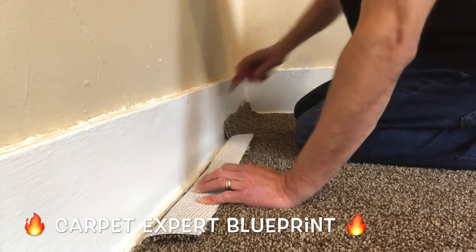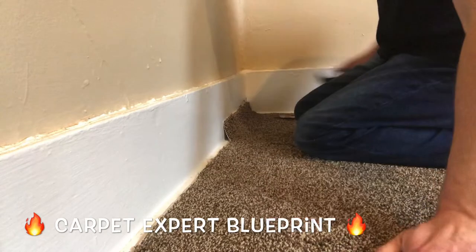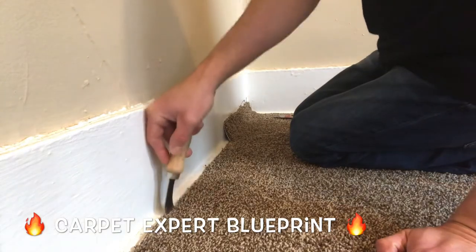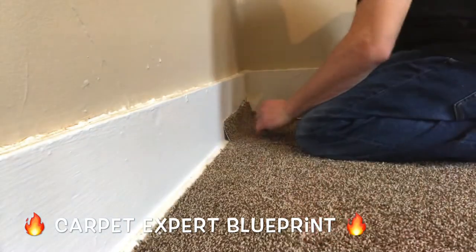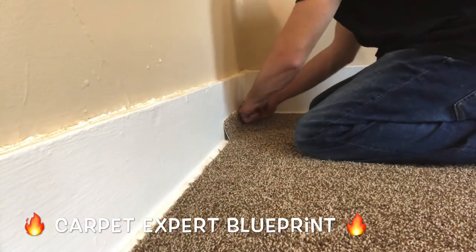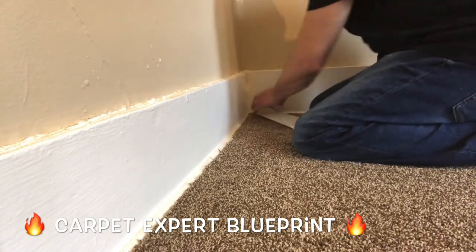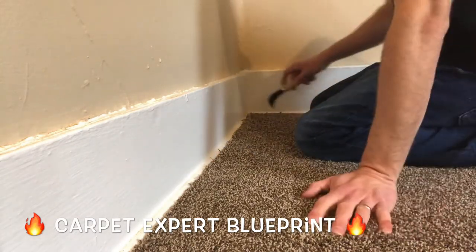Cutting that about a quarter inch hefty. Everything's looking good. Get our tuck knife out and work it down. I know this is so tedious — I appreciate you sitting this out with me here, but it's the reality. You want to know every aspect of the flooring business? We are going to cover every single aspect of it. We're going to lob off this last little section, tuck it in — everything's going to be phenomenal. If you have any questions, comment below. Thank you so much for tuning in and I'll connect with you on the next video.